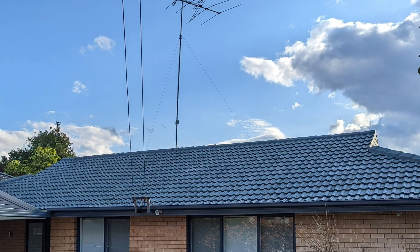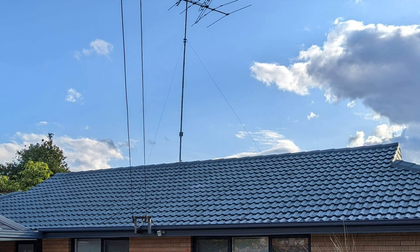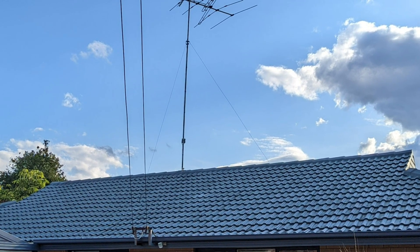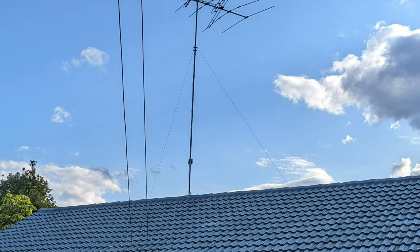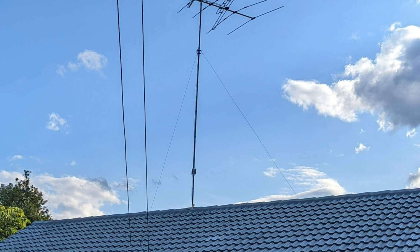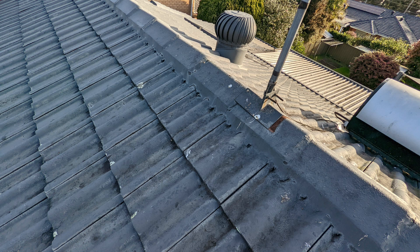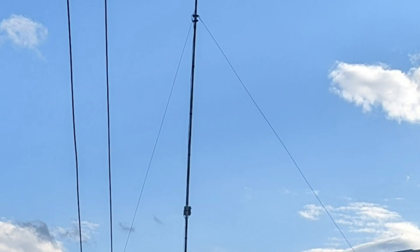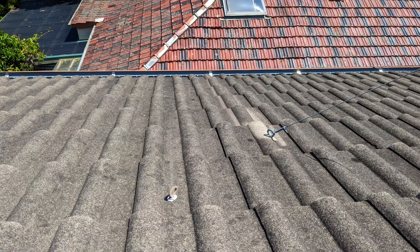If you've got a TV aerial on your roof, then one day it's going to cause a leak. So why do TV aerials cause roof leaks? There are two types of TV aerials that are mounted on roofs. One where the base plate is resting on the ridge and the pole doesn't actually go through the roof, which kind of makes sense. But you still have three guy wires that hold the pole up, because otherwise it falls over.